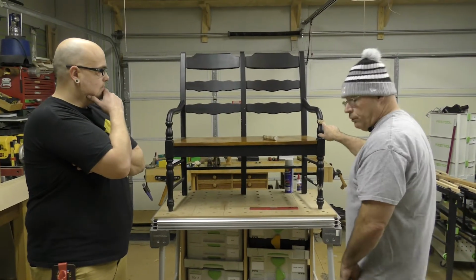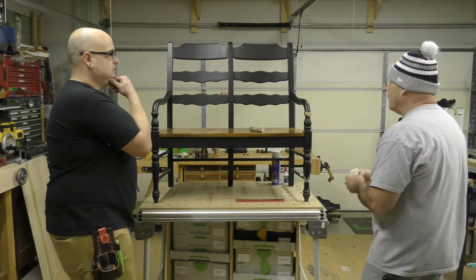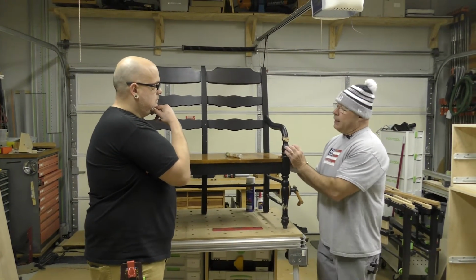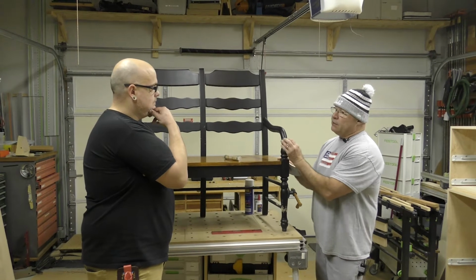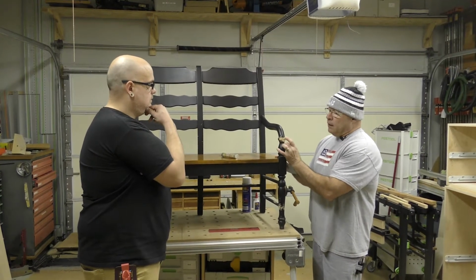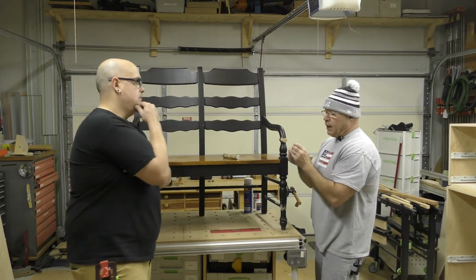All right, let's do it. What we're going to do is work on this really quick, and we're going to use this. This is a Granat soft roll. I use 120. We're not sanding it down. What we're doing is removing the fine hairs that are protruding here. I still want it wicked rough. That way the QuikWood has something to grab onto quick, and it sets up quick.